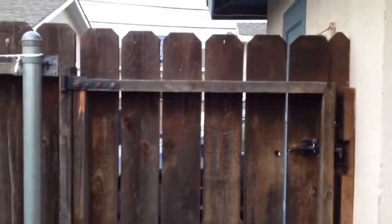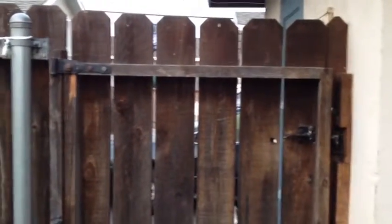We're back to my door that was dragging. As you can see, what I did is took some more deck screws and added them across the boards there, and it did a pretty good job. It lifted up the door now to where it doesn't drag. It actually goes right back to the closed position pretty good. So I think this easy fix worked. Thanks.